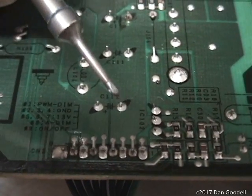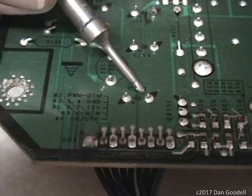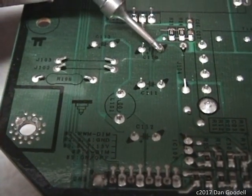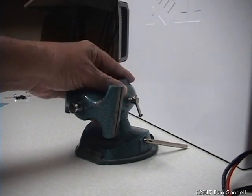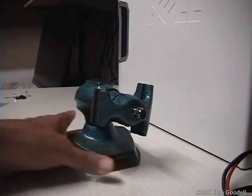If I were working in this densely packed row of solder pads, I'd use the needle tip, but the area I'll be working on today is C112, C111, and C110. I've got more room around these pads so I'll use a chisel tip to get more heat onto the solder pads more quickly. You really need three hands for this kind of soldering work, so I make use of this handy desk vise. It's adjustable and has a rubber base that easily slides around my workbench.